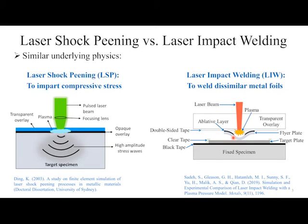The collision between the two 50-micron foils occurs at hundreds of meters per second. If parameters are set up properly, the result is a weld between the two foils that is primarily mechanical in nature. The great thing about laser impact welding is you can weld dissimilar metal alloys — for example, aluminum to stainless steel, which you cannot do by fusion welding. This process works on the millimeter or micrometer scale and can be used in MEMS devices and microelectromechanical devices to weld dissimilar metal foils or weld a foil to a solid substrate.